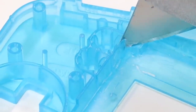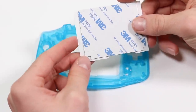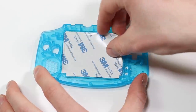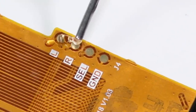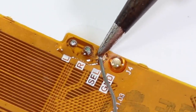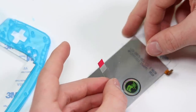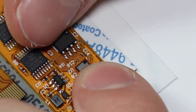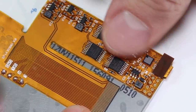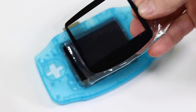So there was a bunch more cutting, a bunch more scraping and plenty more crying. To cover up this carnage, we're going to stick the provided 3M adhesive pad down. It's also a good idea at this point to tin these contacts on the ribbon cable. Remove the protective film from the screen and stick it on the back. Stick this little pad on the ribbon cable and attach it to the screen. Stick the ribbon cable down to the screen and drop the screen into the shell. And to protect the screen, we will install the glass screen lens.